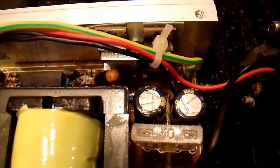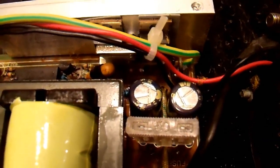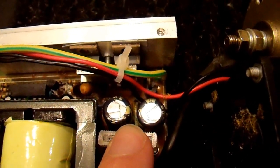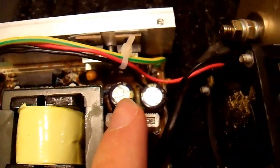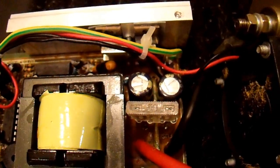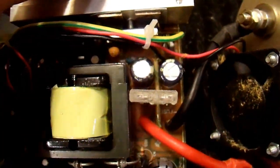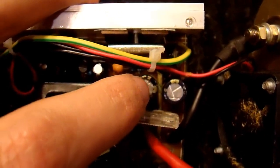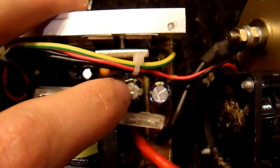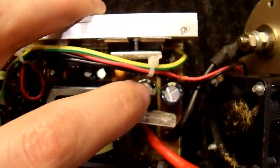In terms of performance, the most important characteristic is impedance at the frequency of interest. I don't know specifically what that frequency is, but these are very high quality capacitors — the ones I removed almost certainly are not, since this is a consumer electronics device. So even though these are 680 microfarads versus the 2200 I replaced, they'll probably work just as well because they are very high quality low ESR capacitors. Also, make sure the capacitors are fully seated directly against the PCB — even a few millimeters of gap will cause problems.